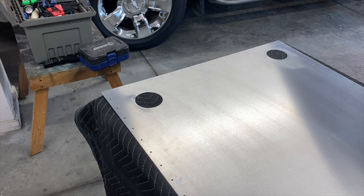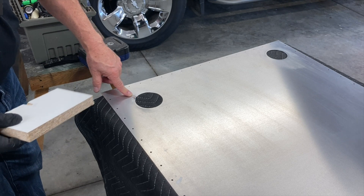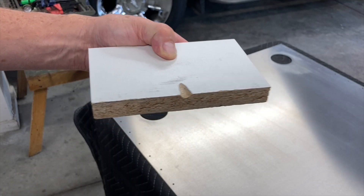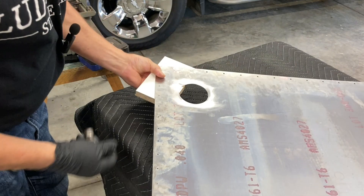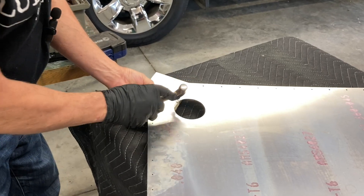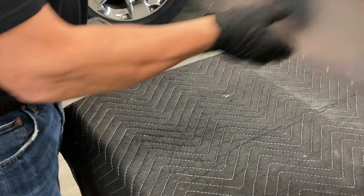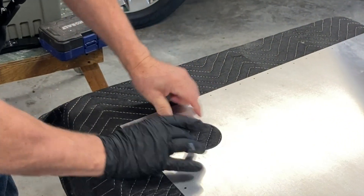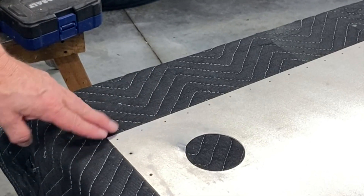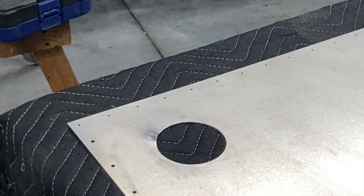When I was fitting the skin over the top of the tank, once the tank was exactly where I wanted it, there was a little tension right here on the panel where the ground goes off the sensor. I cut a groove in this with a die grinder, flipped it over, lined it up where I marked it, and used my hammer to tap that down and made a nice little groove. Now it clears just fine. Later when I put a cap on here, the flange will go out past that and I'll grind out the underside of the flange enough to hide it.